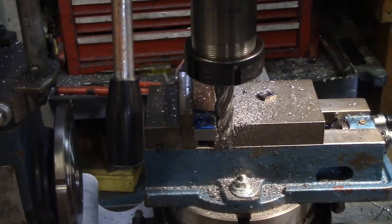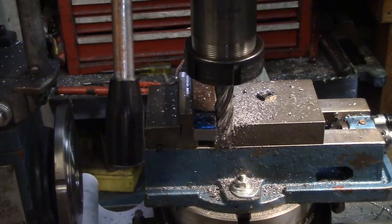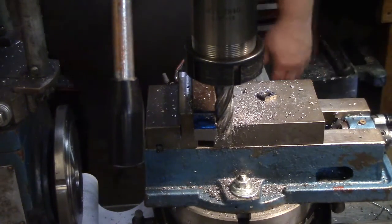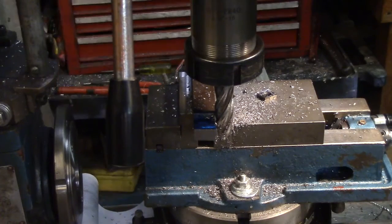Looks like my overload kicked in, which is the absolute first time it has ever happened. Probably a used old bit — I get a lot of these out of the scrapyard. Machine shops do a lot of fine finish work and it's just not economical to have them sharpened, so I pick them up and use them myself. Since it's the first time it's happened I don't know how to reset it. My DRO is still on so I didn't pop the breaker. I'll do a power cycle on it — I can't believe I tripped that out at all. Motor's not warm.